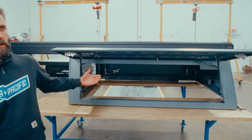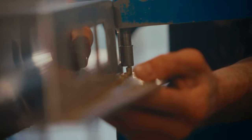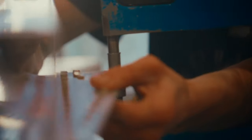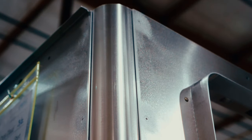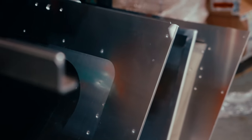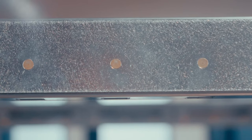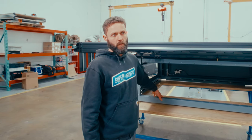And so we drew on some manufacturing techniques from aerospace and decided to use solid body rivets to assemble the parts that build the fuselage. By doing that, because all of the structural connections are done cold as opposed to a weld, which introduces a lot of heat to a concentrated area, it leaves the temper of the aluminum unaffected, and that allows the stresses to be distributed evenly across the whole material, which avoids any sort of concentration of stresses which can cause failure. So that was kind of what drove our design philosophy as we got this thing off the ground.